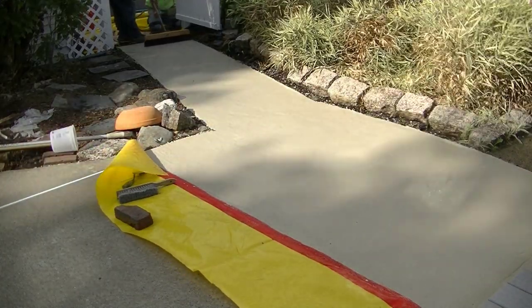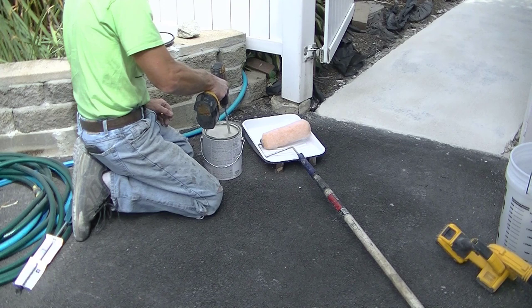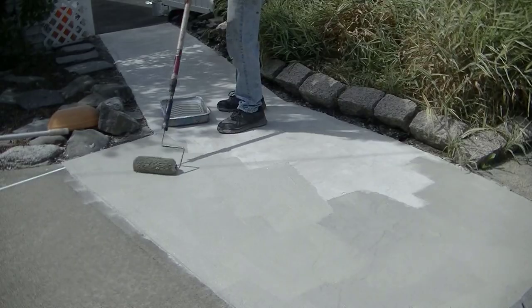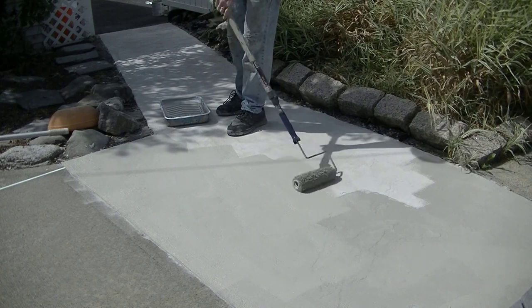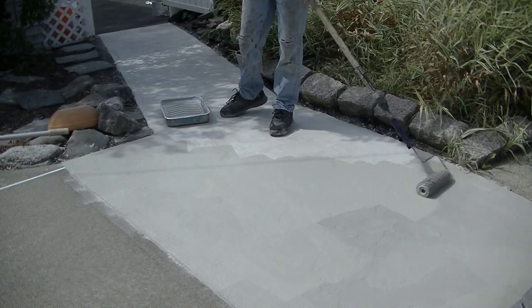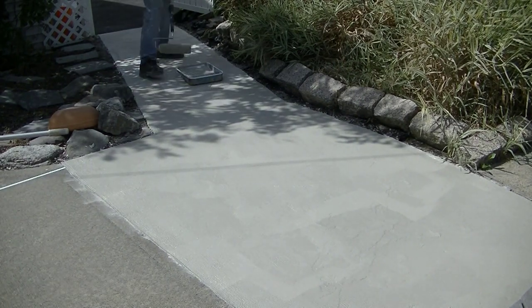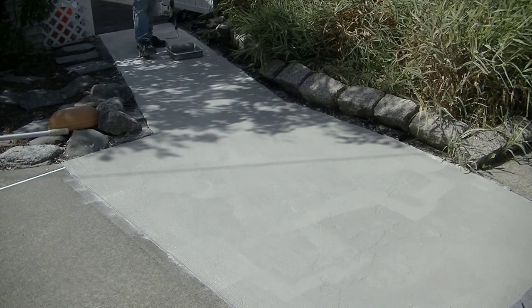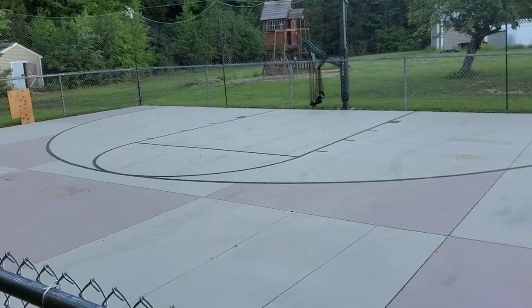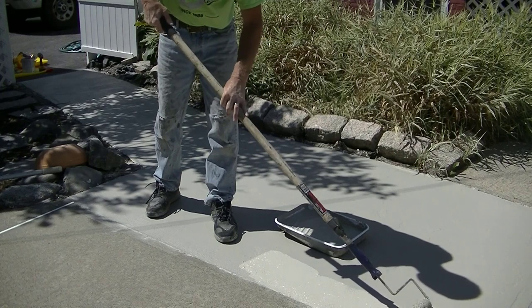So this is the overlay with the broom texture. We'll let this set up — it sets up in about a day — and then we come back and apply our concrete waterproofing sealer. I'll have the video link down in the description about what this stuff is too. We dip and roll this on, and we always put two coats on. It seals the surface right off — it doesn't let water penetrate down into the concrete. There's also a grit you can put in with it, so it's anti-slip. I actually have it on my own basketball court; it's been on there for seven years — we play out there when it's raining and it gives really good texture. Here I am putting the second coat on.